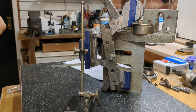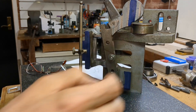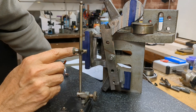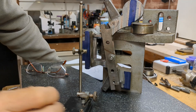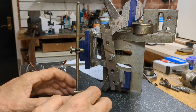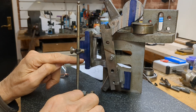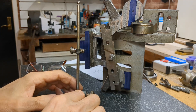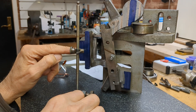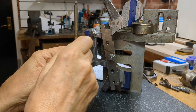On my machine the centre line of the lathe — in other words the centre line based on that distance — is actually 100 thou off the centre line of the bed. So I've dropped down 100 thou and then marked off the edge of the slot. That's because my lathe has been reground; it's not 1.375, it's actually 1.4. So I'm just going to scribe those lines in.